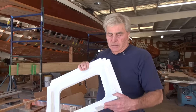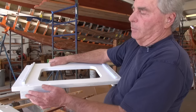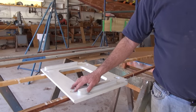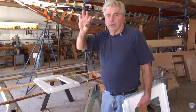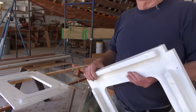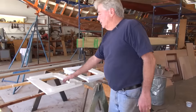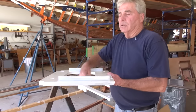This piece — the refrigerator just touches this on the outboard side. So if the boat's heeled over to port, it'll have support here. Plus this cleat, when it's screwed down, clamps onto the refrigerator. The feet sit in these detents — little rubber feet — so they won't squeak and rattle. It locks right in. And then the fascia is screwed on with a flange over the outside. So it's supported up and down, fore and aft, and side to side. The cutouts are mainly for air ventilation.